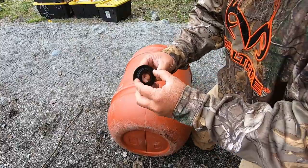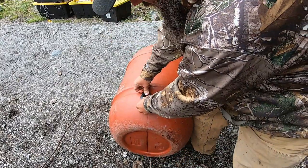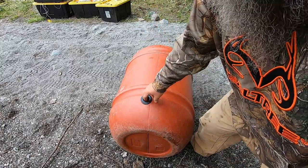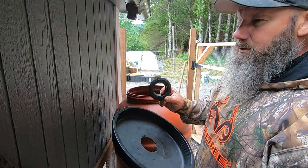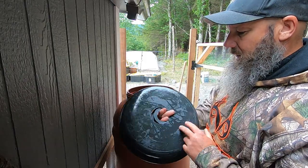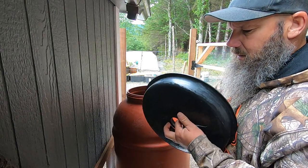All right, here we go. This thing here has a little lip on the end, and it just presses in inside there like that. And when you stick the pipe in, it also swells it out a little bit to make a firmer seal. So what we've got here is a 2-inch Uniseal bulkhead, and we had to use a 3-inch hole saw for it. Let's see if we can get this thing in here without completely wrecking it.